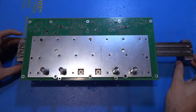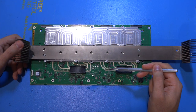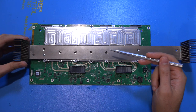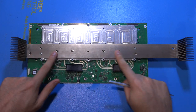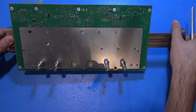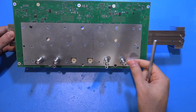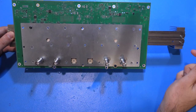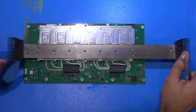So there is the front end here. You can also see there are six cans here, and here are the connectors — the differential lines going to those connectors clearly come from the front end, which is performing some functions we'll explore. Because this thermal section is sandwiched between the boards, they're going to need heat pipes going to the side. They've decided not to route heat from the front — most likely because this is basically the front of the instrument and you want to keep it as small as possible. Any losses you have to equalize in this front end are to your disadvantage. That means there are going to be two-phase heat pipes going through this.